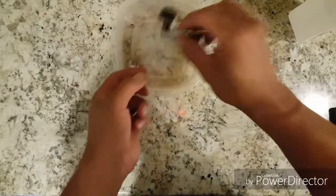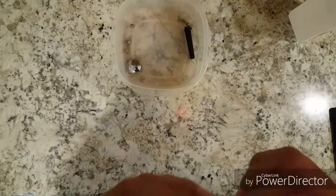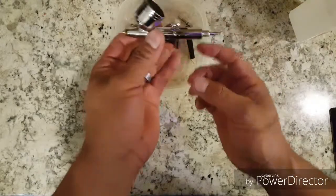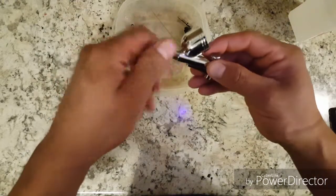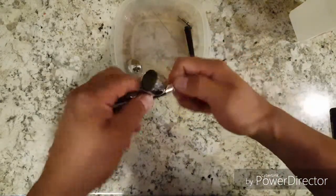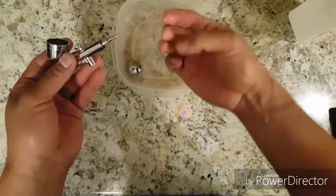After you're done soaking, get everything out. You can even blow through here — and through right here too if you want to get anything unclogged. Blow through this way because there's a really tiny hole, so just blow everything up through this piece. Then you're gonna want to repeat everything you did in reverse. Get this piece, be careful don't damage anything on the tip, and do hand tight on that. Next piece right here, hand tight.